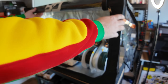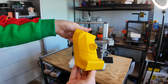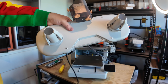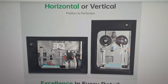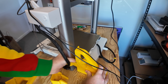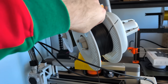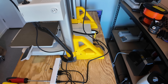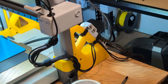For the next upgrade, the enclosure gets in the way a bit too much, but thankfully I had a bit of help to take it down. This is the official 3D printable AMS vertical mount — there's a clasp, a screw, and the whole thing swivels around. It mounts the AMS up top and keeps things as compact as possible. If you're using the Panda Shelter, you can stand it on its side and fit the AMS vertically, but you'll also need to print and install braces since you're putting a lot of weight on top of a machine not really built for it. The swivel is also designed so you can access spools at the back without moving the printer, though the amount of moving parts and the snap fit does scare me a bit.